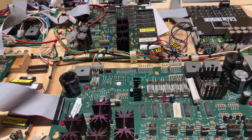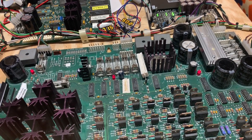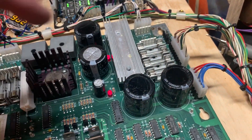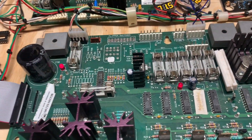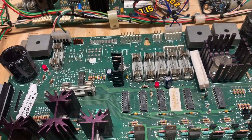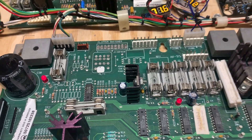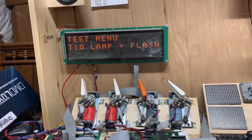This board is good to go. Now, we've got six fuses replaced on this board. I suspect it was a 'hangar queen' — in airline or military aircraft parlance, that's a jet that's in the hangar forever and people steal parts out of it. Two five-amp fuses were stolen over here, and three-amp, three-amp, three-amp, and another three-amp fuse were stolen. These two fuses, most of the time on WPC games that take a type-3 driver board — you can see it's missing all these parts — those fuses aren't used because they fuse the flipper power now provided by the Fliptronics 2 board. Sometimes games use those circuits, sometimes not, but if you're in a pinch for a fuse, it's a good place to look.